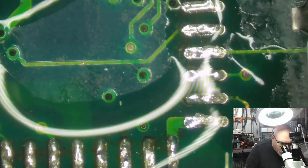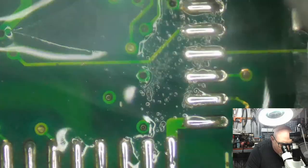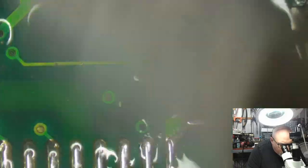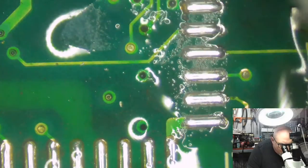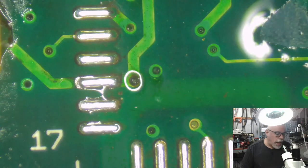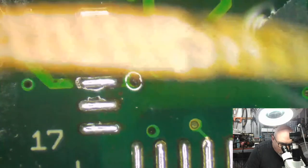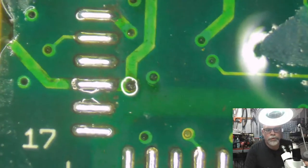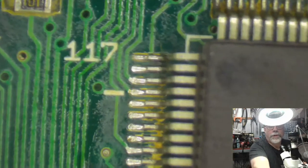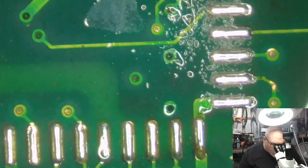I have a video on my channel about doing trace repairs. If you're ever thinking, oh, I'm going to need to do a trace repair, it sounds quite difficult, and I will tell you it is a lot easier to do with a microscope like this, but it is not actually as bad as you might think. At the end of the day, we're just restoring continuity. That's all we're doing. We're just getting a little bit of wire, a little bit of copper or whatever, and joining these things together. So you just need to do it in a way that's going to last.